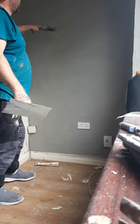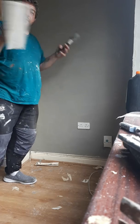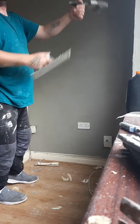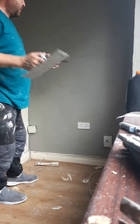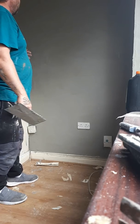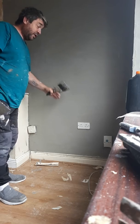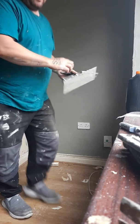And normally when you're plastering, I have another wall on, so I'll be off doing that. I'm going to come back to this, so I wouldn't really be stopping in between. I'll be sticking beads up around the windows, taping up skirting boards, polybonding walls. So you will be kept busy. But if you're just a beginner, the end and the top of that could be ready for another trowel. Now at this stage, we're going to leave that until it's pretty dry.